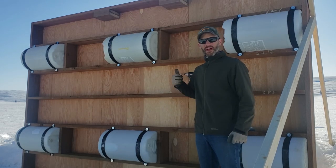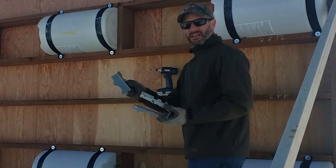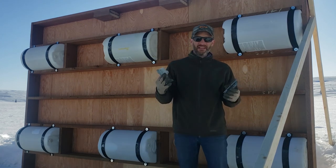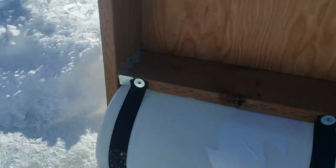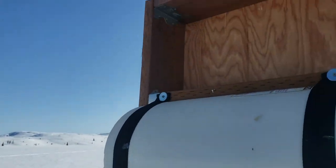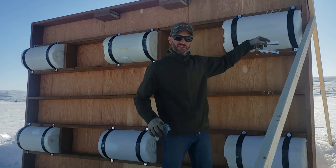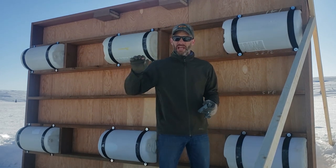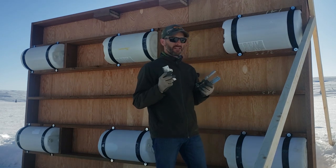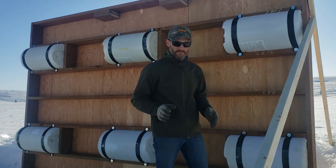Hey guys, so we're back at the dock. We've got to lift it up again. Why, you ask? I forgot a crucial element: joist hangers and L brackets. I got so excited this thing went together so perfectly and I forgot to put the joist hangers and the L brackets on. What this is going to do is give us more strength and more structure to fight against the ice wanting to rip this thing apart in the winter, because we're not going to take it out of the water. So I have to remove the end barrel so I can get these joist hangers in there. I've got the compressor, the generator, some Tico nails, and a palm nailer. I'm going to get these things in here lickety-split and lay this thing back down. Then we can let it rest in the ice and the water until springtime. Thanks for watching, guys.